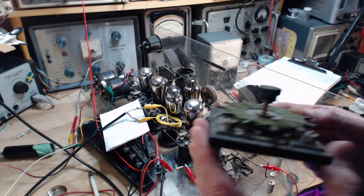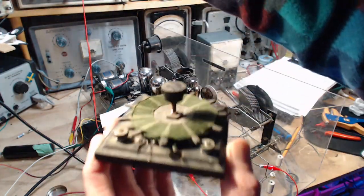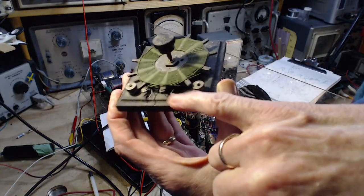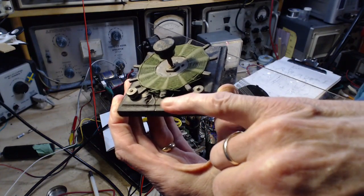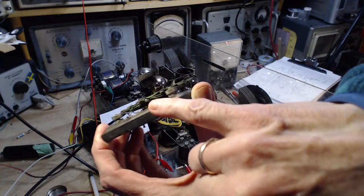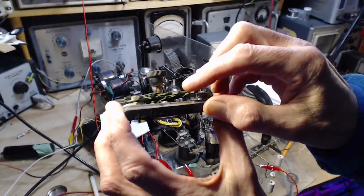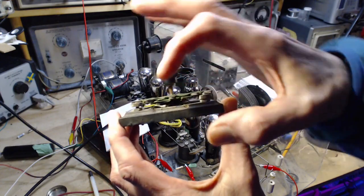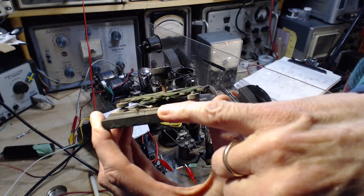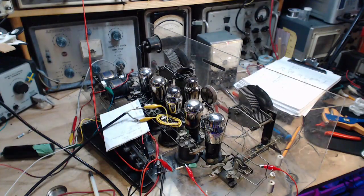Okay, and taking an even closer look here. As it turns out, this screw, which I did rotate, is not connected to the wire. You see that little blob of solder there? That used to be under here on the top of the screw head. It's not me. It's been off the whole time. This other one, the screw head is still soldered. You can see the blob of solder on it. So it's hung on. That's what's going on.